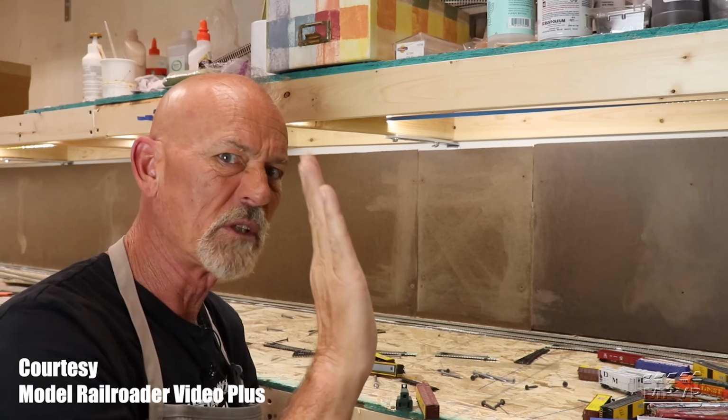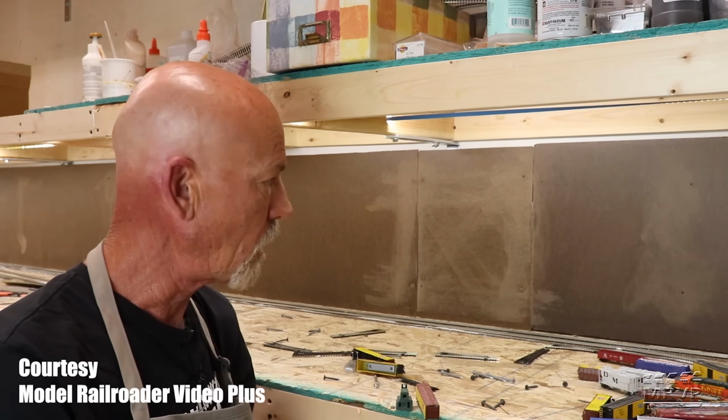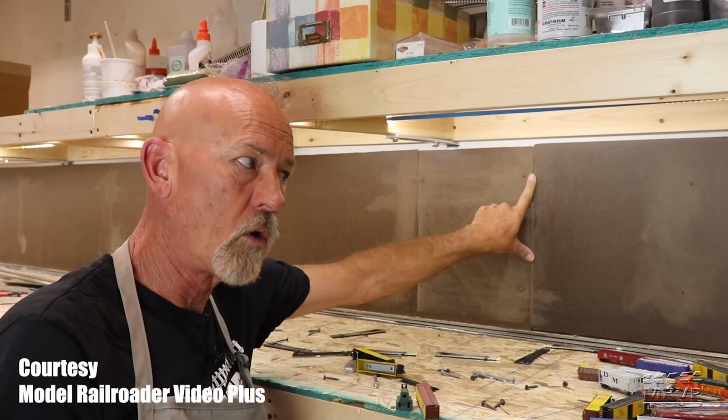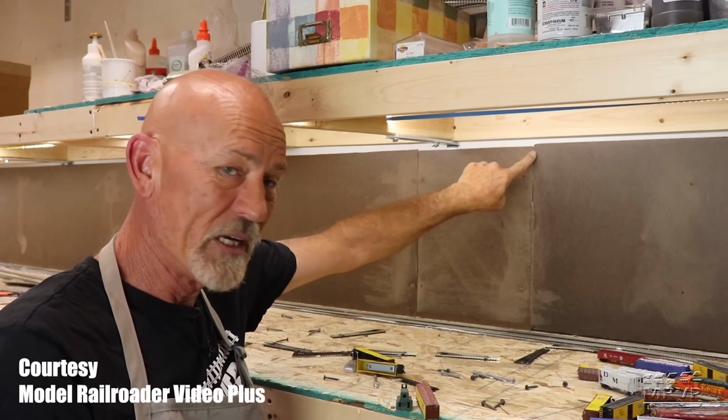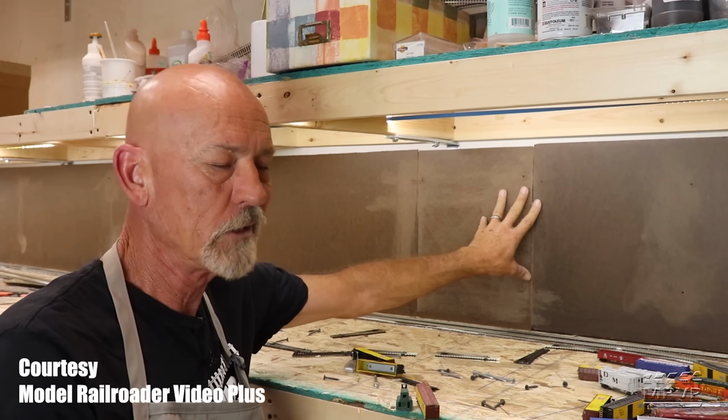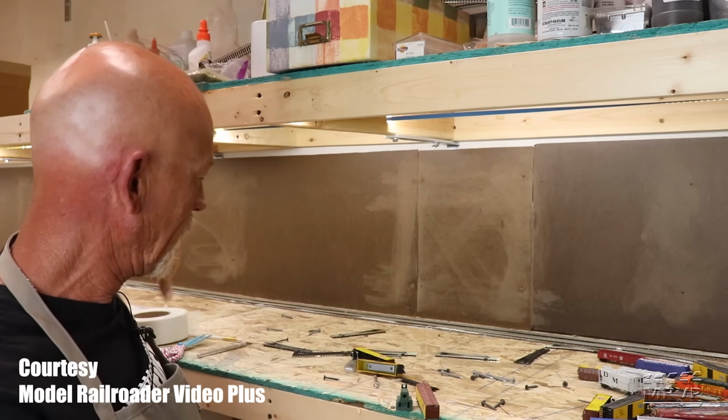All right, so with all the sanding done, we're gonna go through and cover over the seams now. Some of the smaller holes, we'll just put the drywall mud in there, boom, call it a day. But on these bigger seams, here's the thing, earthquakes or any kind of shifting of the house, and it's my belief there's gonna be a crack that'll form right there unless we do some kind of reinforcing. I don't know, maybe it's overkill, but here's what we're gonna do.